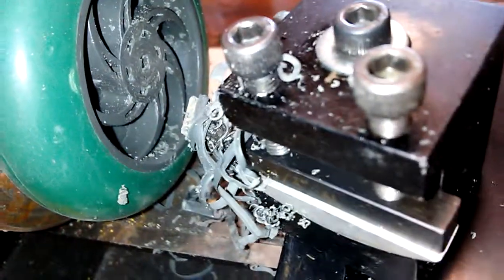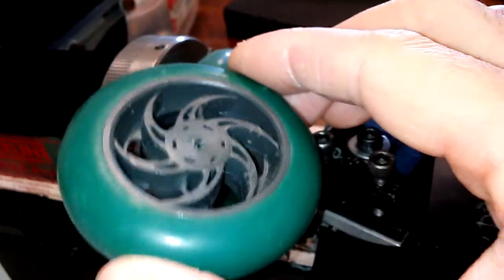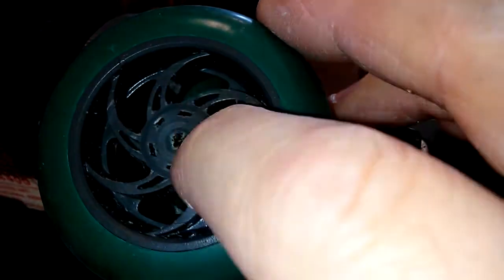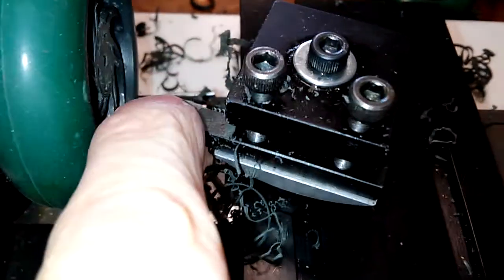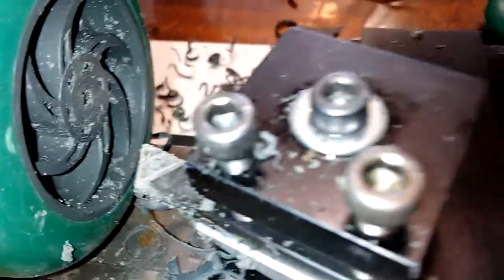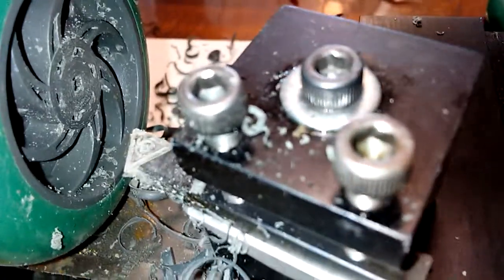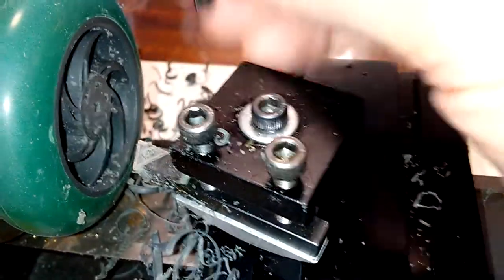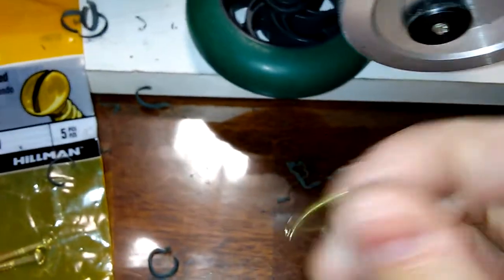Testing with my finger — feels pretty flat. Since I'm doing these in bulk, I'm making them flat first and then going in to drill out the center piece. It worked out to about 1.5 turns. I'm going to change to a tool that angles to the left instead of the right, get it centered, then pull out on it. That generates a hole that is really nicely centered. You put the horn on it and that little bump just fits right in the horn, then you put your washer on and your screw.